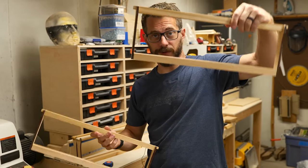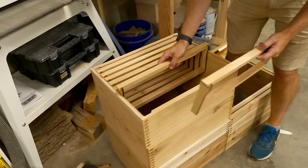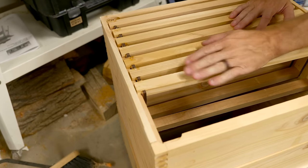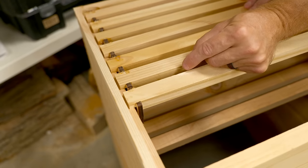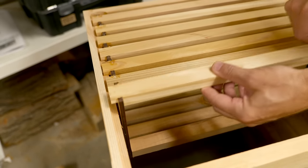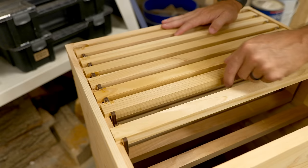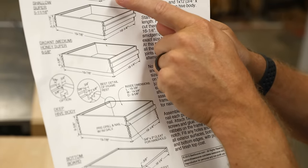It's the next day. All of our frames are glued up — they're in good shape, and I wanted to show you how they go into these boxes. You just drop them in and they land on that little rabbet that we cut. These little pieces that come up on the sides act as spacers to make sure they don't get too close, because any gap that's less than about three-eighths of an inch the bees will fill up with a wax-like material. So we're going to make sure to keep these apart so you can easily take them in and out. This is supposed to hold 10, but we miscalculated a little bit so we can really only fit nine — but that'll give them a little bit more space. We've got all the boxes done, so it's time to move to the covers.